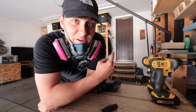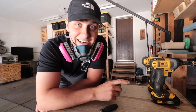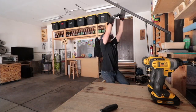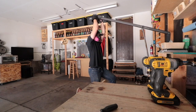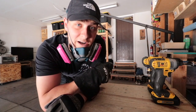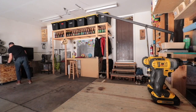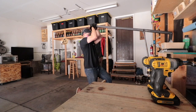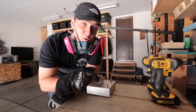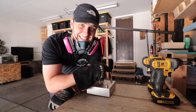Since I initially built the machine to make a disc, it can actually make six to seven minis at a time. And because I have multiple molds, I can inject one after another. Let's do it. Once I've injected one, I hold it in place for about 15 to 30 seconds, and then it's on to the next mold. Now it should just be rinse and repeat, but since I only have four molds, I have to get the mini out of this mold before I'm finished with the fourth one. It's a little tricky.